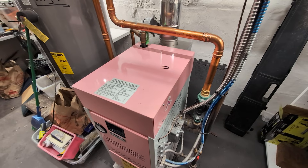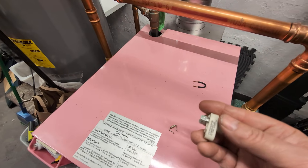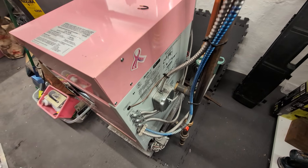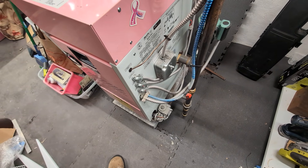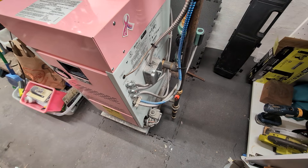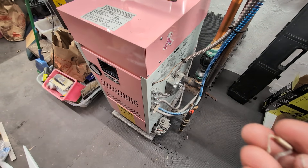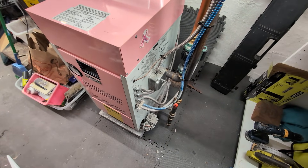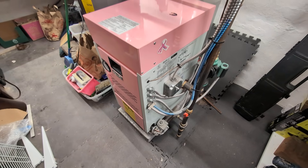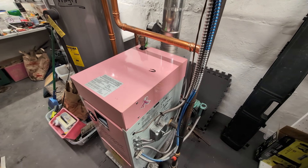What called me out here since we installed this was that the rollout switch burnt out. We think what may have happened is there was slight over-gassing — only about a half inch of water column pressure when I looked at it — so I backed it out a little. I think the repeated stress of being slightly over-fired may have caused this fusible link to finally give up the ghost. We've got a new part in, backed off the gas input slightly, and I think we've got several more years of trouble-free operation.